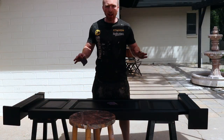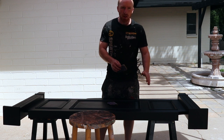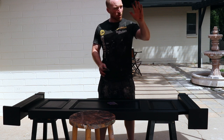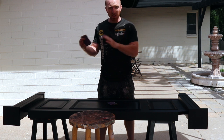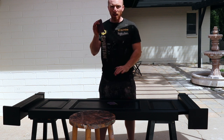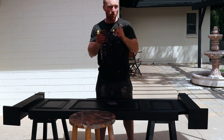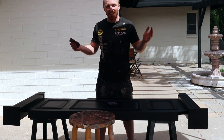We've got it painted, and this is a step that you could skip if you wanted to leave it solid, but we're going to scuff it up. We have the old 80 grit sandpaper here. We're going to scuff the same way on the headboard, the footboard, and the rails — whatever we do on one side of the rail we need to match on the other. Same with the footboard and the headboard: if we go a cross pattern, we need to keep that same cross pattern on the headboard also. Keep that in your mind, and let's get started.